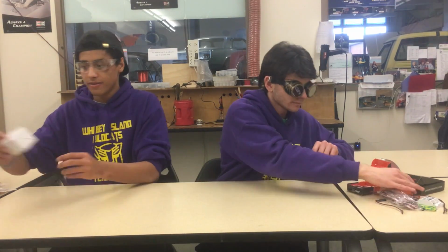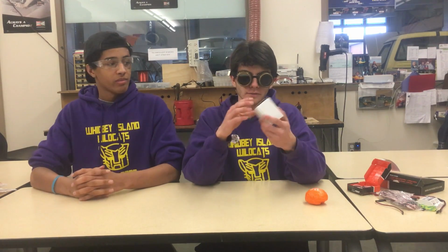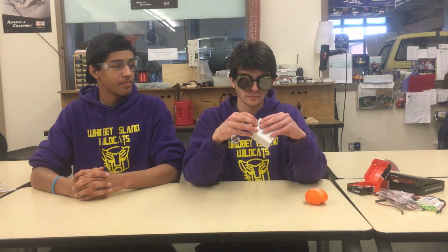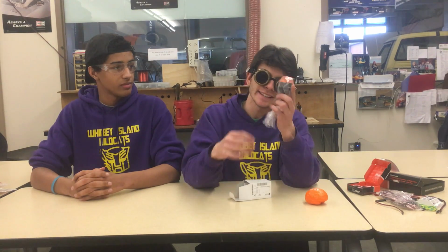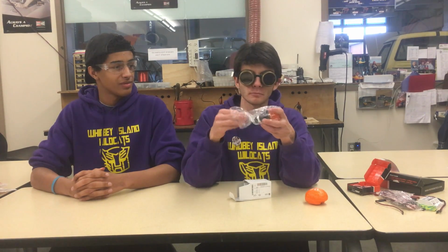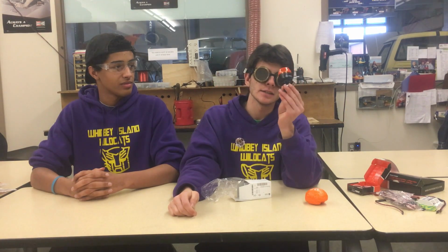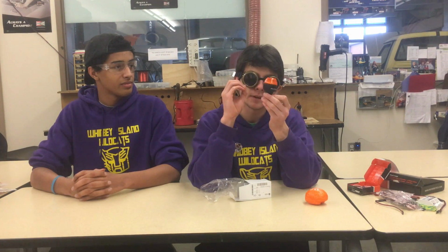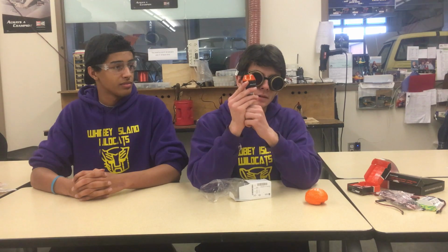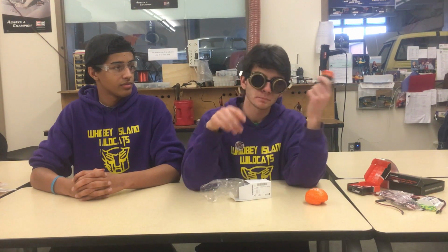Next we have a little white box. We do. We have a teeny tiny little white box with no advertisement, so probably not from a sponsor, at least not a huge one that feels like advertising everything. We have Blinky. Senior mentors, mentors and senior people on your team will call this guy Blinky. He is your safety light essentially. If the robot is enabled, he will give out a steady orange light. If it's not, but your robot is still on but disabled, he will blink, hence the name Blinky.